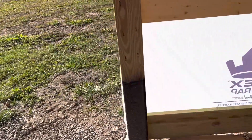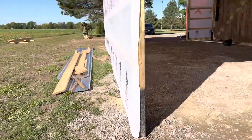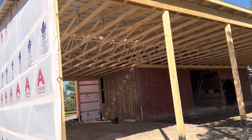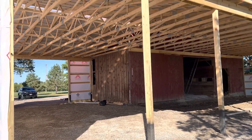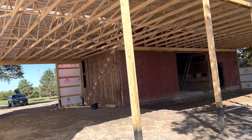Here in the state of Ohio we go down 54 inches and put that in the hole. So that gives you an idea. You can see a one-foot overhang right there. The trusses are actually on two-foot on center. This is going to be the open section here — again 50 by 30.